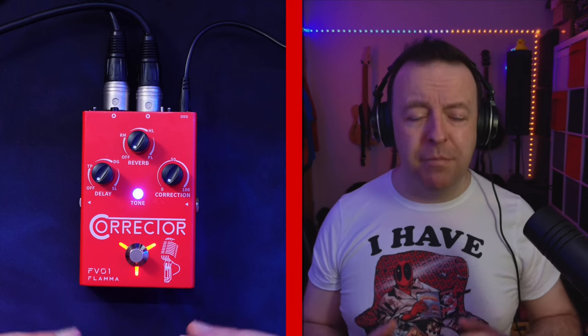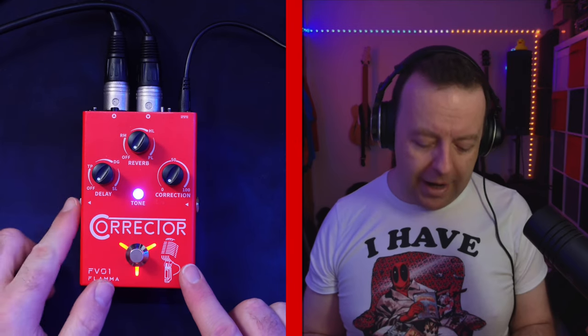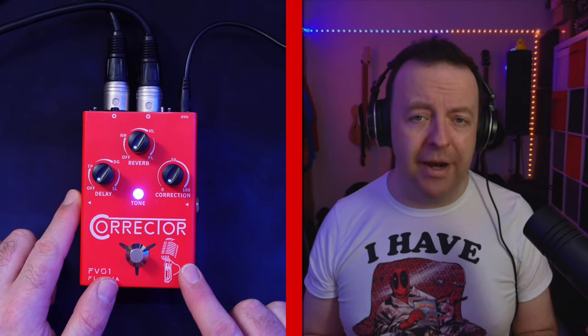However, if you put it into red mode, which is mixed mode, means the signals from the guitar and the microphone are mixed together and they will actually come out of both the XLR and the quarter inch jack guitar out, no matter which one you use. I think most people would actually leave it in the normal mode where everything's separated, because then you can mix it or send the guitar to an amp while you send the microphone to a mixing desk.